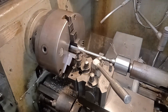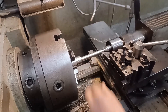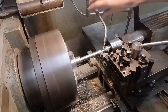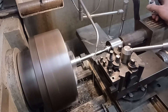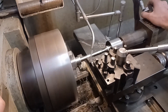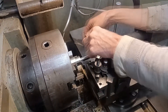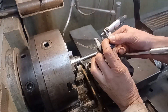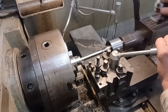It's the most microscopic amount. I might just do a spring pass — I don't want to overshoot this. I'm aiming for 15.85. I'm going to wrap it up and put it in balance. So I'm at 15.97 — just got to go a little bit more yet.